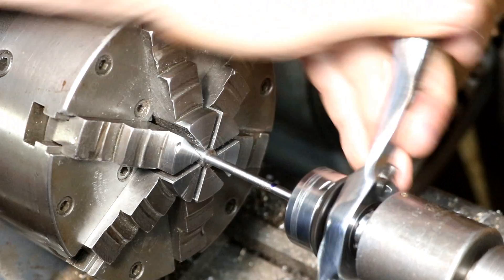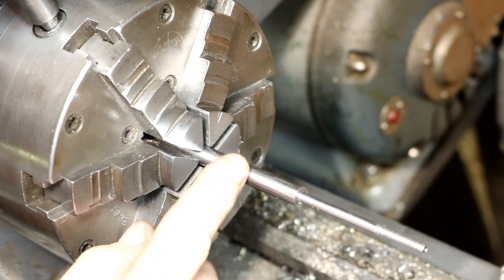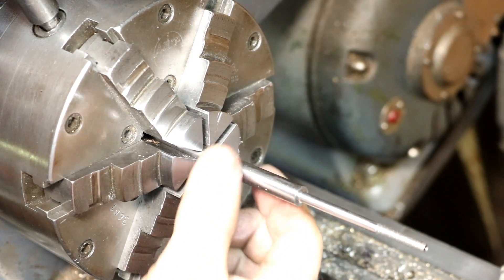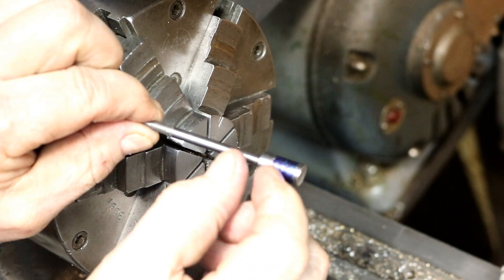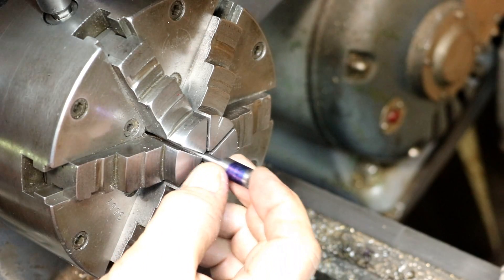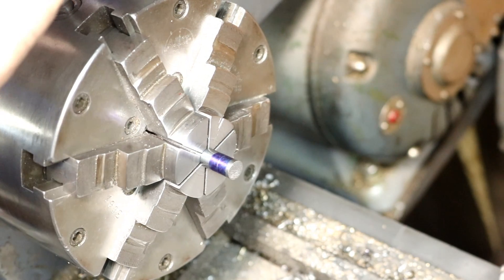10-32 is the thread. We'll take that out, go cut this off, and form the other end up. I marked this where the end needs to be — this is going to be 0.437" long — and we're just going to slip it in here and do that.